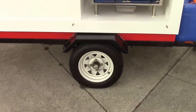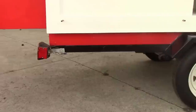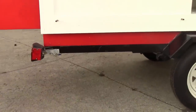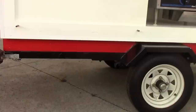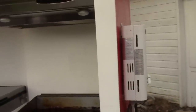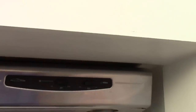The trailer was a Harbor Freight trailer. I made a mistake when I built it — I didn't realize how much room I was going to need. No blueprints, I just did this on the fly. So I added two feet off the back — you can see right there, that little step is where we welded on. I used a bed frame; it was the strongest thing I could find. Then I laid down three-quarter inch pressure treated. Everything has been primed with oil-based primer, all joints are caulked, and all the wood has been primed inside and out. I went a little beefy — probably more than I needed to, and that added some weight.